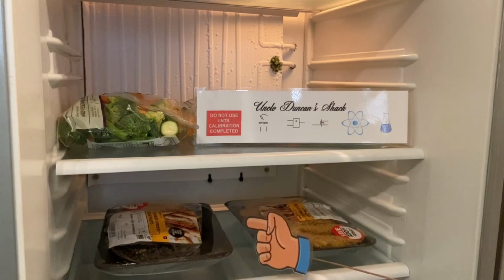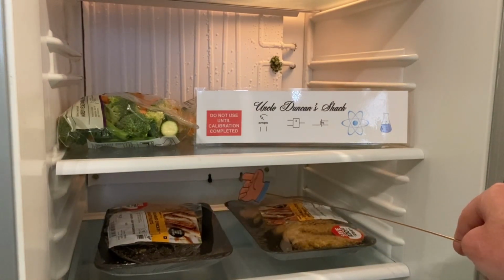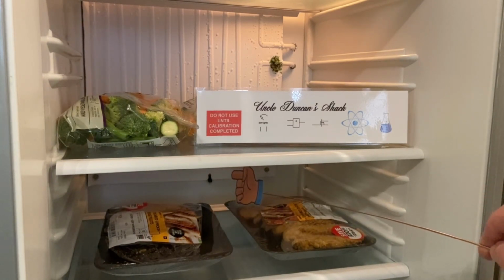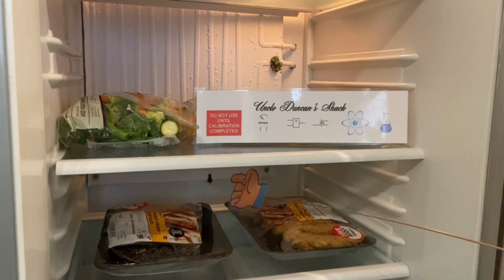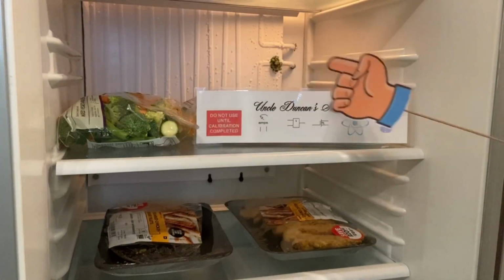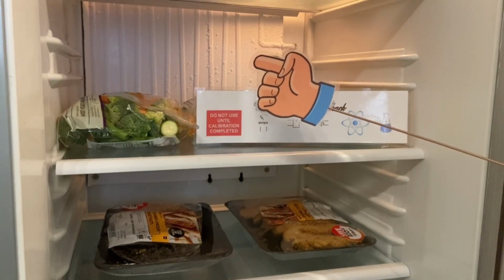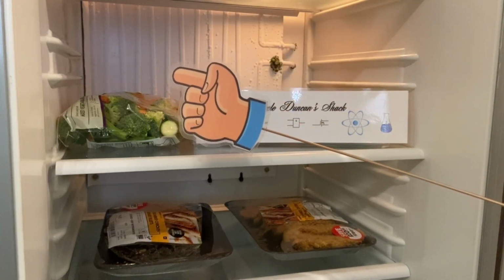The thermostat capillary, I just zip tied to the bottom over there, as you can see, after drilling 2 holes in the evaporator plate. I just 3D printed some standoffs for it, and 4 thick screws through the standoffs holding it in, and there we go. That's the interior part of the fridge serviced.